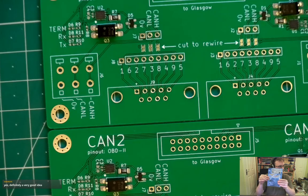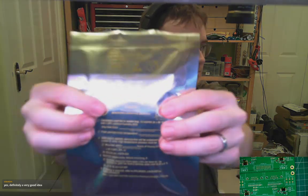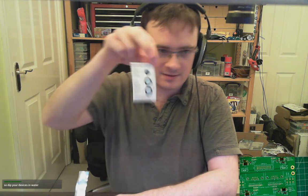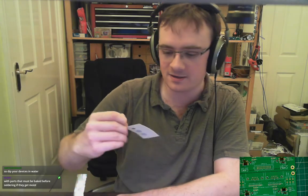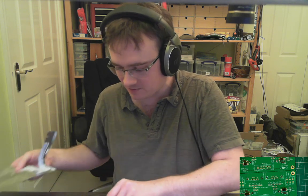Inside we will probably find a card as well. If you have had these open they are therefore untrusted moisture-wise. There's a pack of desiccant and a card. Over time these indicator cards go red, and you're supposed to bake the parts for a certain number of hours to get all the moisture out before you use them again.